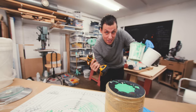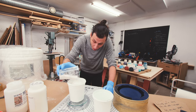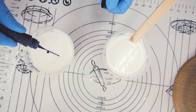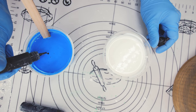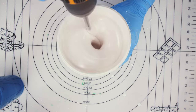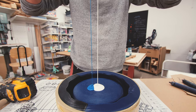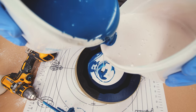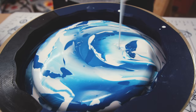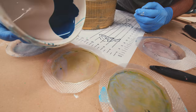While that one dries, let's try a different mold with a different pattern. Again we measure up all the powder and liquid and make colors — white and dark blue with a tiny drop of black to make it even darker. Mix these up, then instead of gradually mixing them together, we pour them in at the same time. I sometimes like to pour one into the other as they flow down to create a swirly pattern. When I have a little bit left over, I pour it into coaster molds from my first vacuum forming video — that way nothing goes to waste.